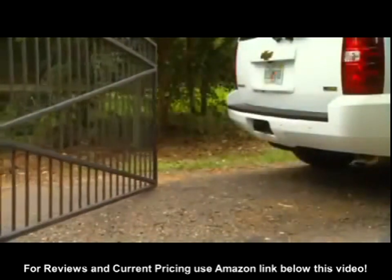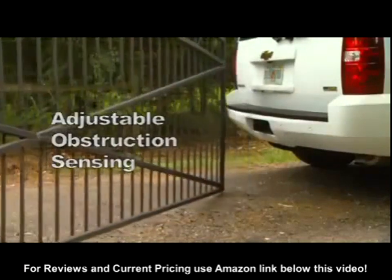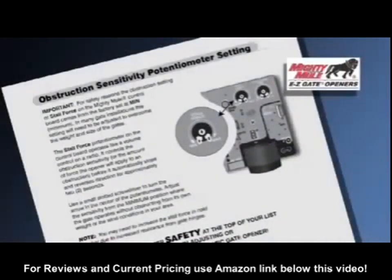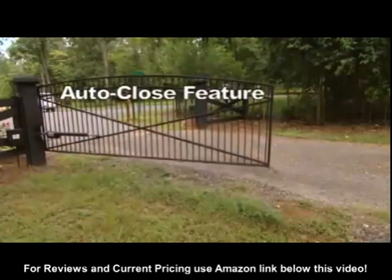The Mighty Mule 200 gate opener features adjustable obstruction sensing. This safety feature makes the gate stop and reverse direction within 2 seconds after coming into contact with an obstruction. Refer to your manual for instructions on how to set stall force settings. Pay close attention to this adjustment if you are installing the opener on a heavy gate or a gate installed in windy conditions.